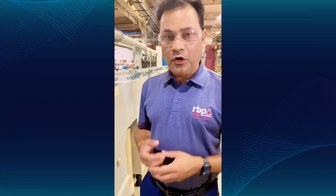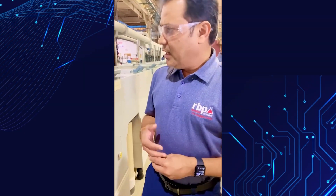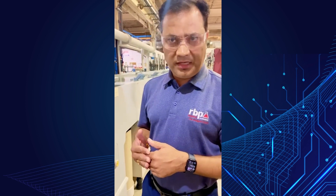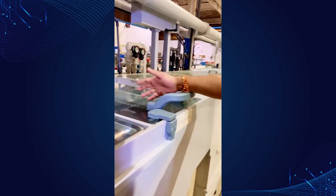The second step is called Onyx, which is the graphite-based colloid. It puts a very thin layer of conductive coating on the hole walls, which helps to plate copper onto it. The module is a spray module with an impingement fluid head on top and bottom, which helps pass the solution through the holes and vias. It also has squeezing rollers to prevent drag out.